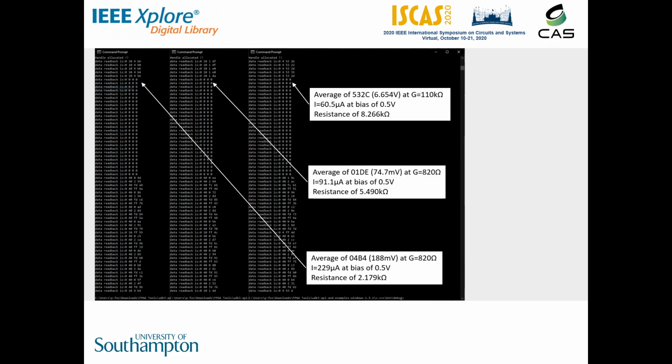Here are some example readouts from this demonstration. The top 5 lines are averaging data from channel 1. The bottom 32 lines are readings from the end of auto-ranging phase for all channels. Please note that this config has a minor bug in which channel 17 always reports the same range data as channel 1. Channels 2 to 32 show a non-zero value because this value is the point at which the FPGA decides that the channel is close enough to being settled to declare that the auto-range is complete. Actual average data from an empty channel is much closer to 0. The lines between these two clusters of data are empty and irrelevant.